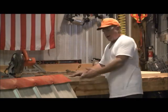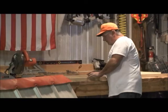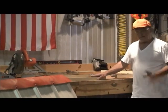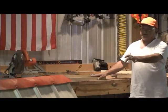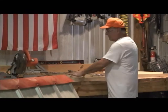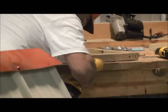Chicken wire and make a ramp style just like the other one. And like the other one, the dimensions of this will be wider than the hole itself, and it'll be mounted on the outside so that any animals trying to get in won't be able to push it in easily. First we'll pre-drill it, we'll screw this together, cover it with some chicken wire and mount it.